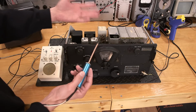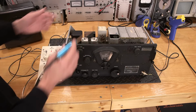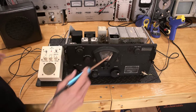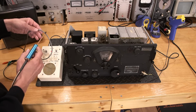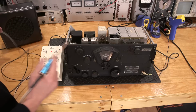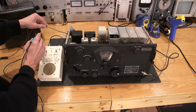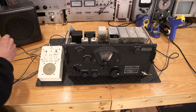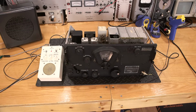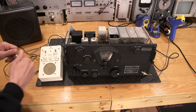So that's hearing the audio come right off the tube. So this is the audio at the audio transformer right here. So I wonder if there's anything in the speaker leads? So there's audio in there, but there's nothing coming out. That's really odd, right? Very strange. So I will go grab a jack here. Let's just try a different jack. See, plug something in the front maybe. These are the speaker jacks here. They're covered, headphone jacks, whatever you want to call them.